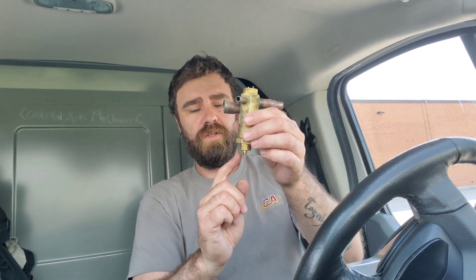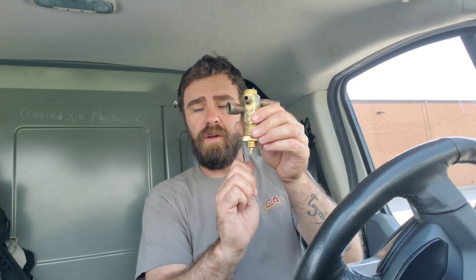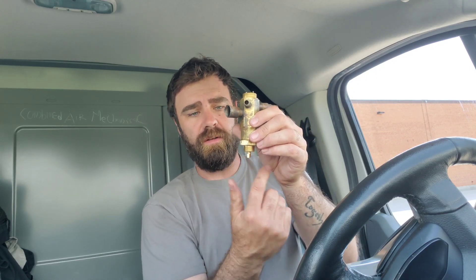And the adjustment right here — spring tension. Increase spring tension by going clockwise and you will increase superheat, because you're allowing less flow through the valve. Decrease spring tension and you decrease superheat because you're allowing more flow through the valve. That's it guys. Happy HVACing.